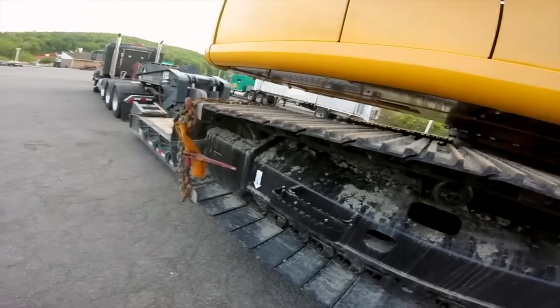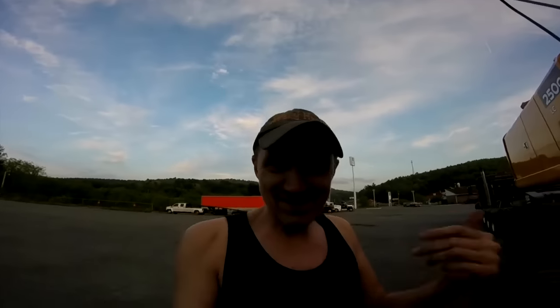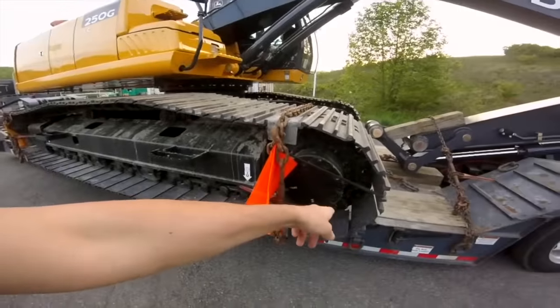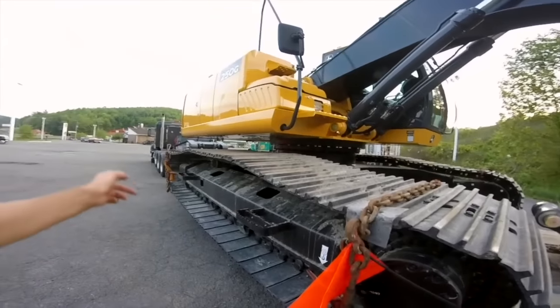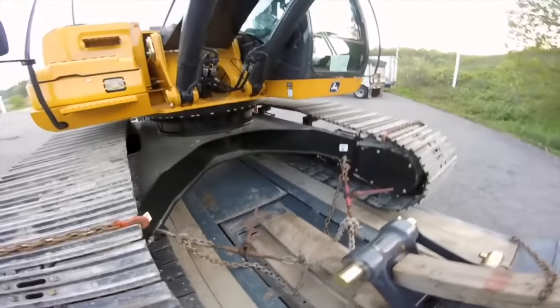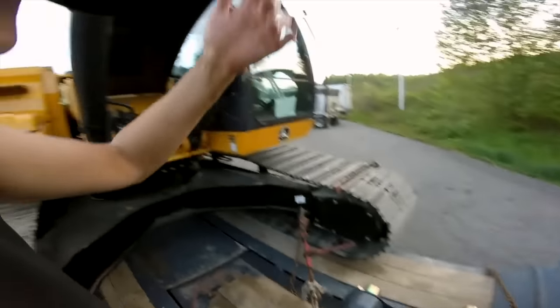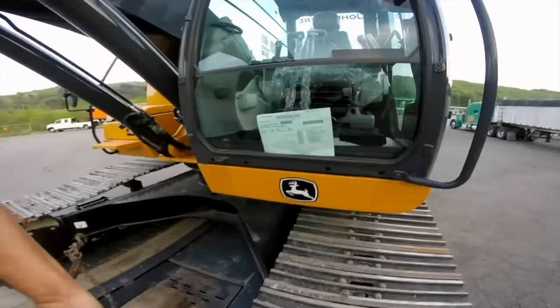You can't just put one on the end - there's a big wheel here so the track is much stronger there. And I asked the guy who was loading: please load it so that when I unload I push the sticks to go forward. For that to happen, the rear of the machine has to be here. So right now the house is pointing the wrong direction - when I unload I just turn the house and it'll be real easy driving.